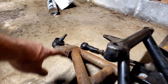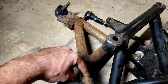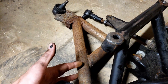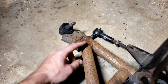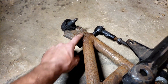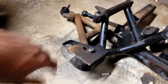The other thing I need to do is finish off my control arms. Eventually I want to redo these — instead of being a triangle or A-arm shape, I'd like to make it curve around and come up, so this piece still comes straight out but curves around. These will be good for now, they don't cause any problems with steering. These are just the ends of a Grand Prix control arm cut off and welded on here, so I'm going to clean up this area and cap it off, and hit these areas a little more to make it more solid — we obviously don't want breakage issues on something like that.